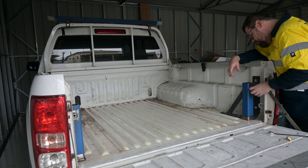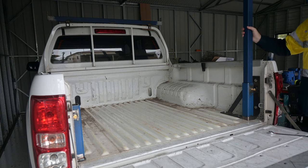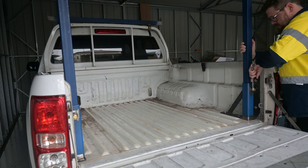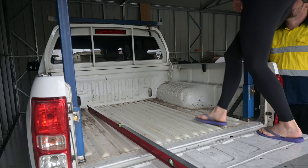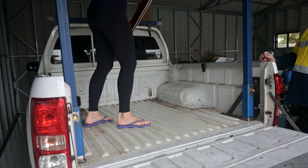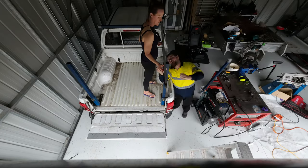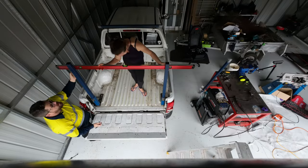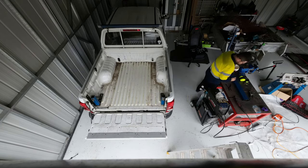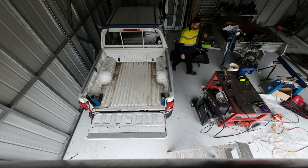To work out our height, I needed to install the front bar and sit the uprights in place in the brackets. I recruited a helper to hold a straight edge from the front bar to the rear to get that height. The ute has quite a bit of rake when it's unloaded, so there's not much point taking level from front to back, so I just made it so the straight edge was parallel to the top of the tray. I then marked the height of the uprights minus the rear bar and made the cuts.